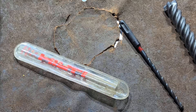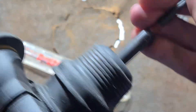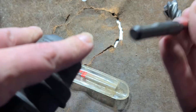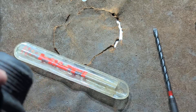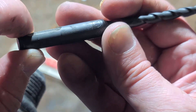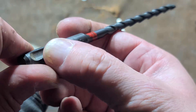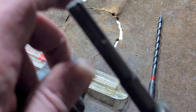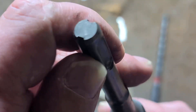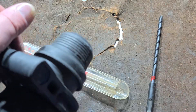I'm glad they use push chucks because on this newer DeWalt, if we try to take the Hilti bit, it doesn't matter — the DeWalt has a push-lock chuck, but this bit won't fit because it's hitting these drive splines. The reason they came up with these drive splines is that on small quarter-inch bits this is fine, but as it's hammering, the retention ball bearings are what's giving the twisting force, actually driving the bit itself. That ends up pounding out the ball bearings, causing the chuck mechanisms to either lock up or drop bits. So Bosch's bright idea was to add a couple of really deep splines so the splines take the load of driving the bit forward, and the retention balls just keep the bit from falling out — making the chucks last a lot longer.